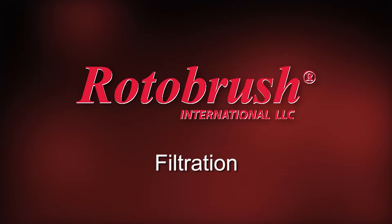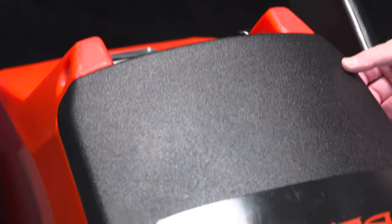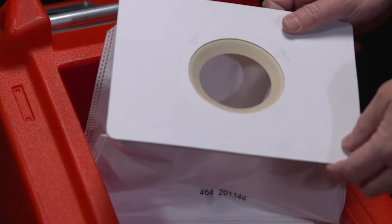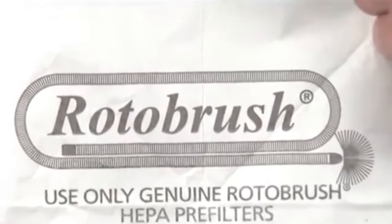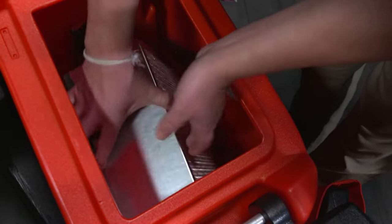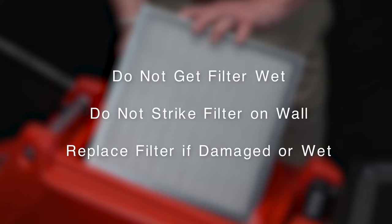Next, we will talk about filtration. Your machine comes pre-installed with a filter bag and a HEPA filter, both located under the lid of your unit. The filter bag can be removed by sliding it out from under the metal tab. There is a flap you can fold over to prevent spilling dust. You can fill the bag halfway before needing to change it, and use one bag for multiple jobs or multiple bags per job depending on the application. HEPA filters need to be cleaned with compressed air from inside out or contact vacuum from the outside. Never get these filters wet — if they get wet, they are ruined. Do not beat them on the wall, as the end cap or glue could break.